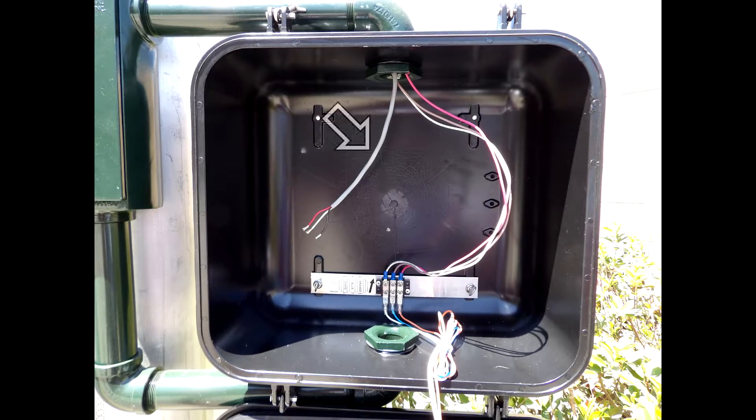Install the 3-Wire cable from the Ped-Head to the base of the pole where the button will be mounted. Be sure to leave enough cable to reach from the base of the pole to the button. Remove approximately 2 inches of the outer cable jacket and strip the inner conductors to approximately ¼-inch.